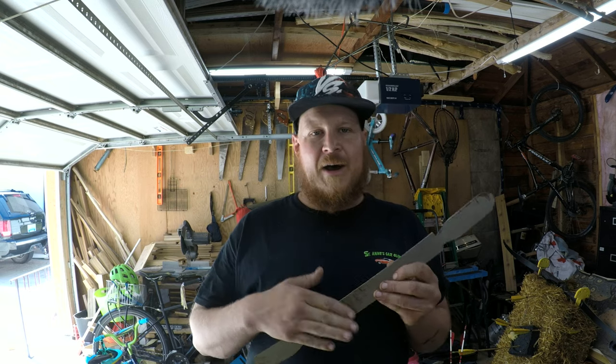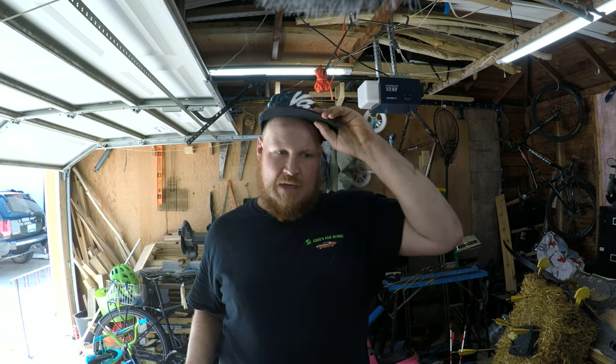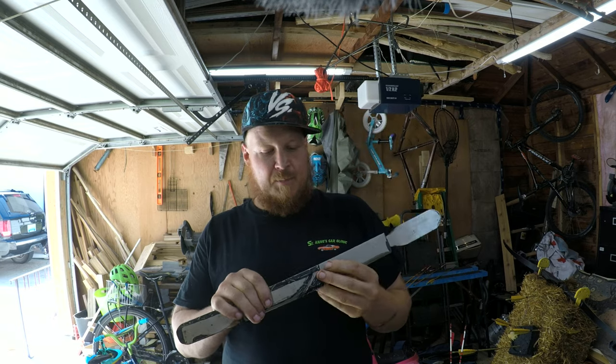I'm pretty excited. I haven't actually built a knife in quite a little while. I don't have a forge yet, so my heat treating is going to be with a torch — I'll show you guys how to do that. I'm not going to be hammering out the knife. Basically, all I do is buy O1 tool steel blanks. Here in Canada, in Manitoba, I get them at the metal superstore. They actually have a pretty neat section of knife making metals, and all the blanks are actually the perfect thickness.